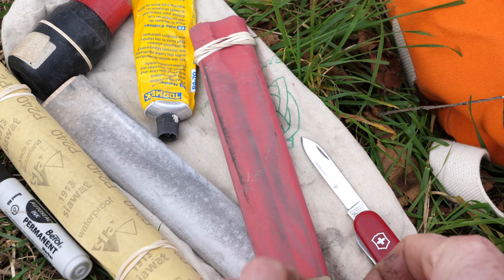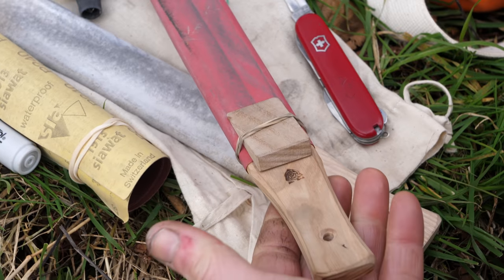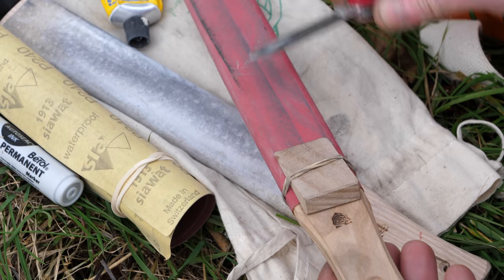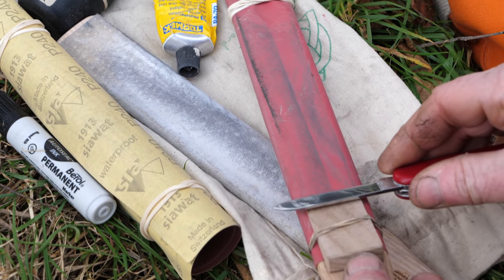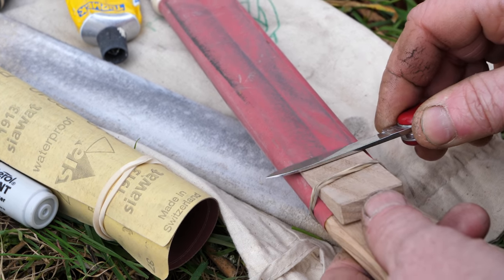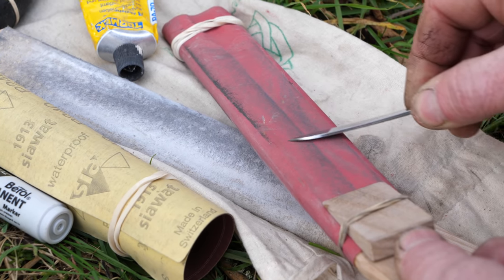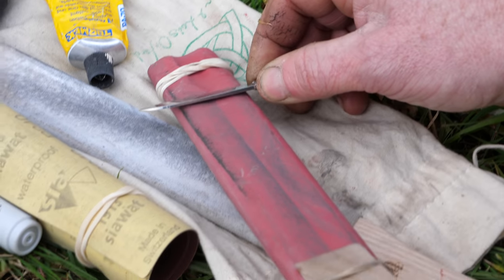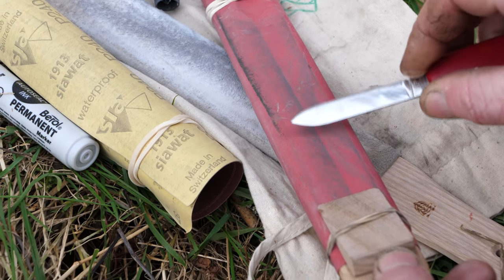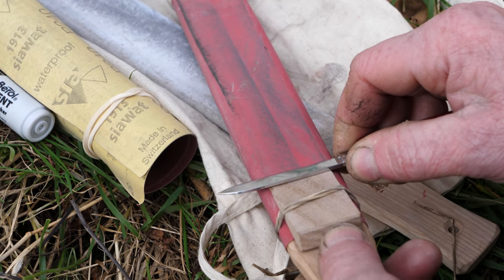Because we're using our little angled block, the easiest way to hold it in place is to slip it under one of the rubber bands at the end — that will also help tension the sandpaper and serve as our reference point. The only disadvantage of sandpaper as a sharpening medium is that we can't push the knife into it — we can only draw it away from the cutting edge. Use your little angled block, lay the whole blade against it, and that gives you the angle. I then lock the wrist holding the knife and draw down the sandpaper, away from the cutting edge. Towards the belly and tip of the knife, you'll need to lift the back hand ever so slightly to keep that bevel in contact with the sandpaper.